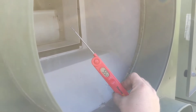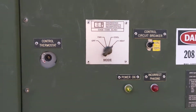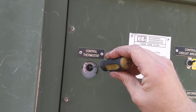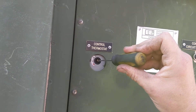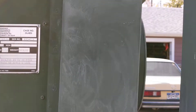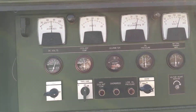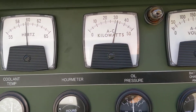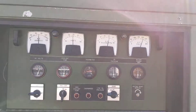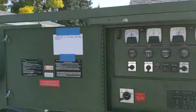I'm gonna go ahead and select heat — let's just show you the heat kit works. It won't obviously call for heat unless you adjust the temperature above ambient. Pulled load again, and right now we're just over 30kW. It's a 30kW heat kit, so that with the blower makes sense. The generator pulls that load pretty easy.